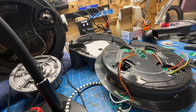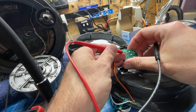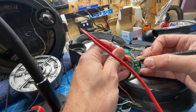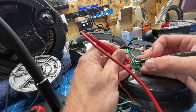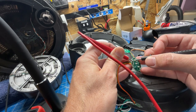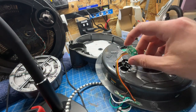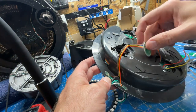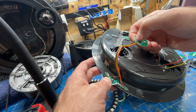I got my multimeter — I'll get a tone if the wires are continuous. Let's touch these two. Yep. And just to make sure — nothing else beeps. It's only those last two. So why they did this I'm not quite sure. You would think it'd be just as easy if they basically soldered these to the same trace here since they're connected. Why didn't they just connect these traces?